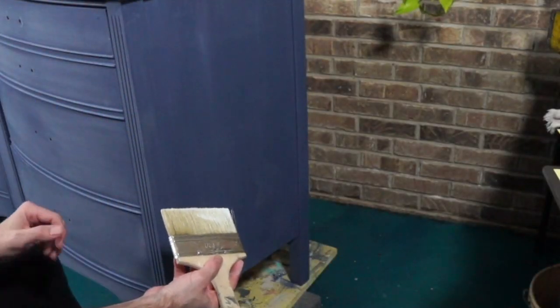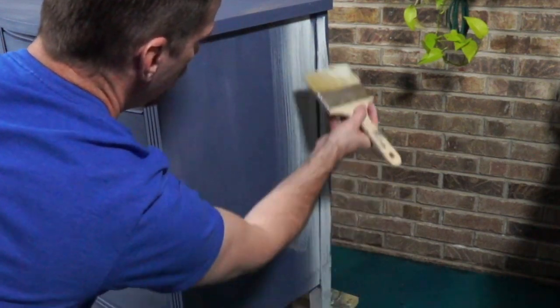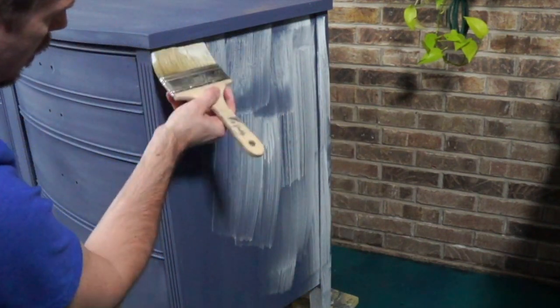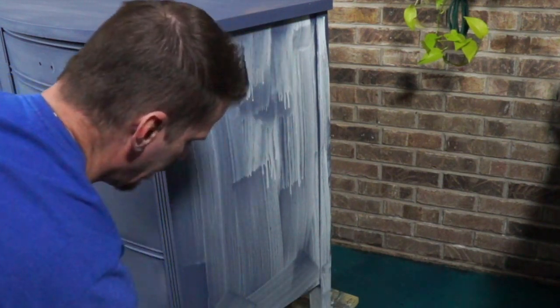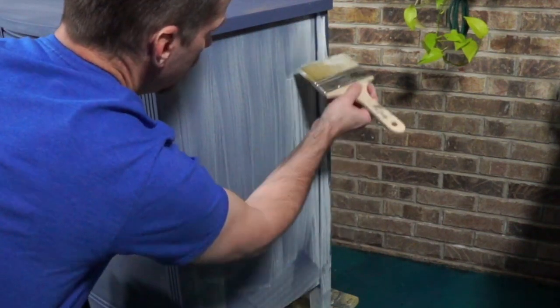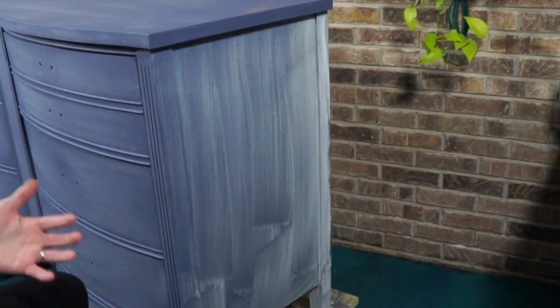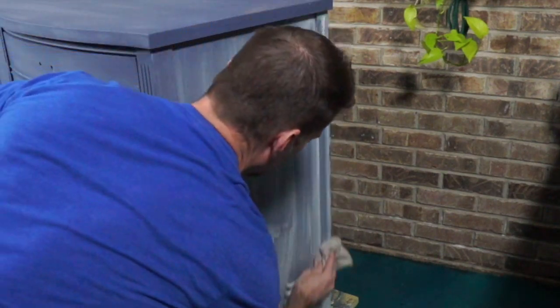We're just going to get that paint right on there. The beauty of this brush is I can work quickly — you don't want to work slow here because it's a wash. Let it run. One thing you might consider: let the paint you put on there dry a day to be safe, because since I painted it earlier this morning, it could actually wet-distress when I run the rag on it. So watch out for that. At this point you could leave it — I'm just going to lightly wipe it off.